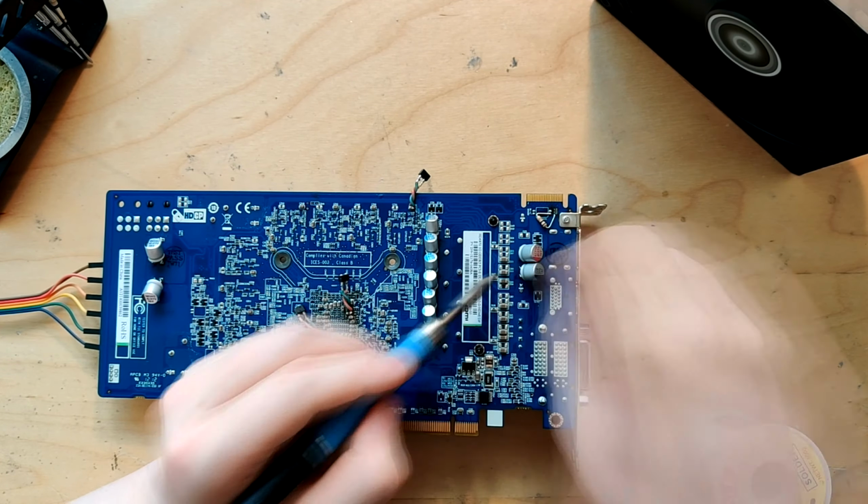Yeah, so, when it comes to the V-Core VRM, in stock configuration, this thing was undershooting by 80 millivolts. Now it's undershooting by 60 millivolts. So that's 20 millivolts less undershoot. That's cool. The VPP also went down from 185 millivolts to 145 millivolts, which is pretty much spot on the 150 millivolts peak-to-peak optimum that I expected.